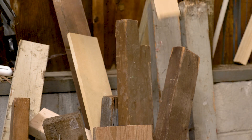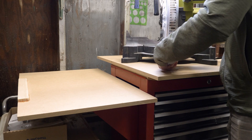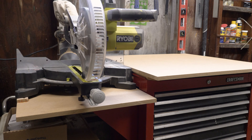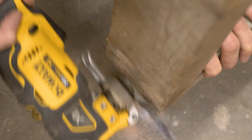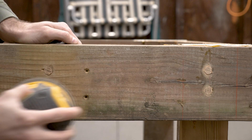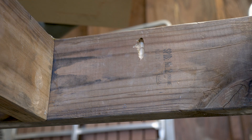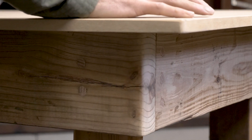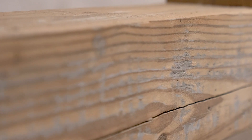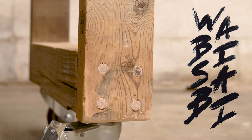She was leaning just a little, so I had to visit the scrap bin and add a little material to make it level with the top surface, but it turned out great. I shifted back to finishing up the workbench by chopping off all the little nubs, sanding it down a bit, and attaching the tabletop with pocket hole screws I had left over from my SUV camper project. It was really starting to look like a table, and I actually loved all the imperfections — the Japanese call this love of the imperfect wabi-sabi.